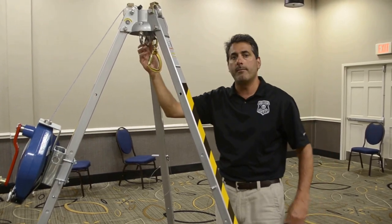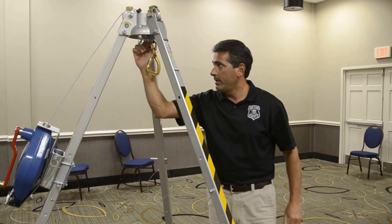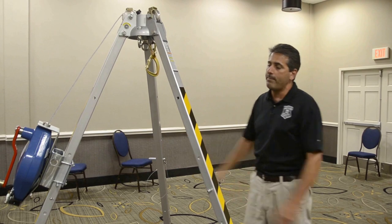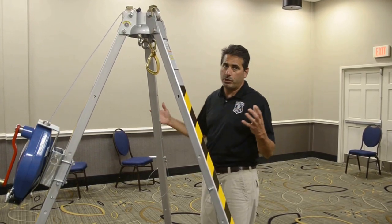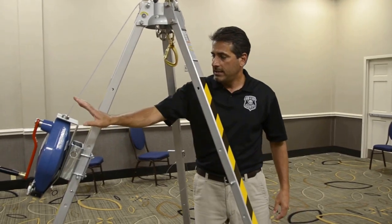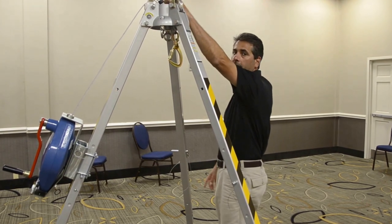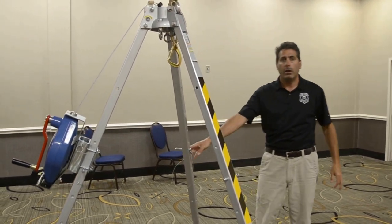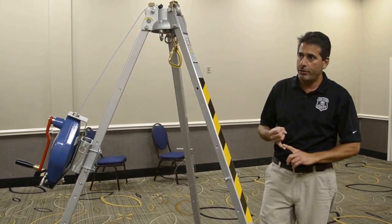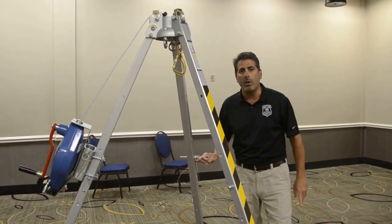So they should be tied off if there's not a guard wall — this is something they can tie off to. A small six-foot Fall-Tec Door-Tec Mini could be hooked up to that to keep your hole watch guy safe. This tripod can be rated for three devices, so if we have more than one person going into the hole we can add another rescue system and an additional pulley, plus a material-rated winch to lower two workers and equipment down.